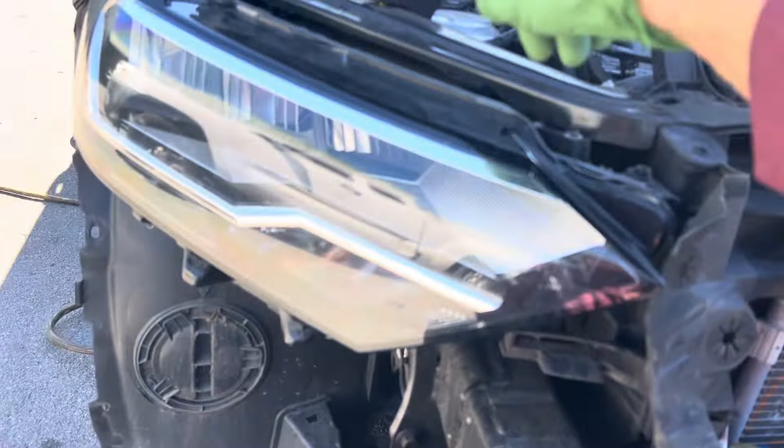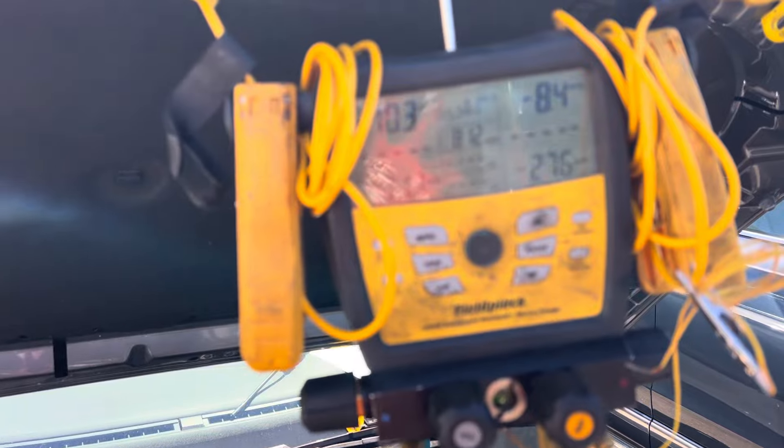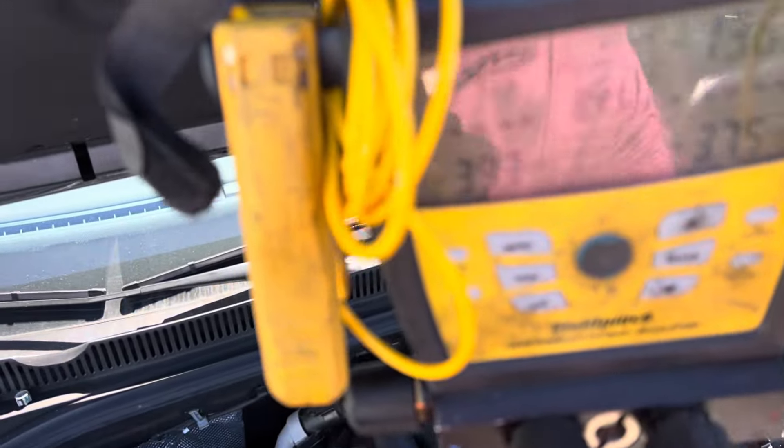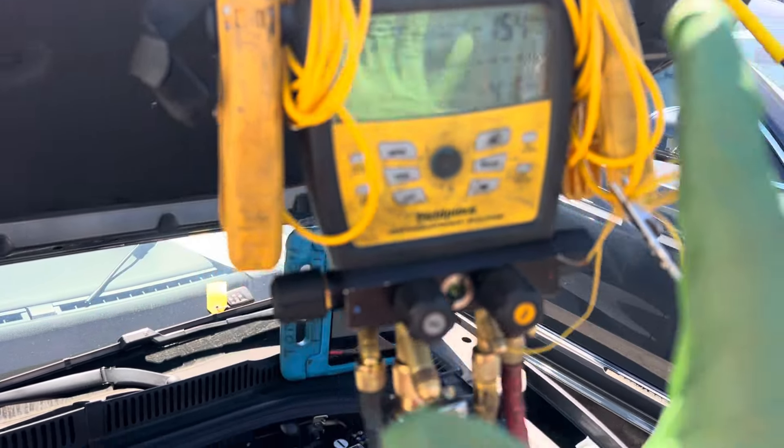The suction line is far away from the compressor and far away from the evaporator — that's your least likely place to pull oil. You can slow down and throttle your recovery machine so it goes a little bit slower, and monitor your sight glass to make sure there's no liquid going past it. That's it — we're empty. That's what I love about these machines; recoveries are so quick. Now that I'm at negative 10 on the liquid line, I know there's no more refrigerant, so I can open up the high side and pull refrigerant vapor out of both sides without fear of pulling liquid.